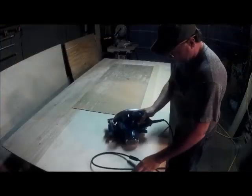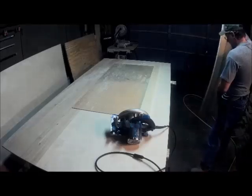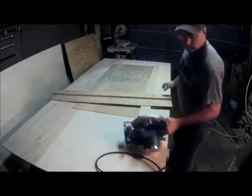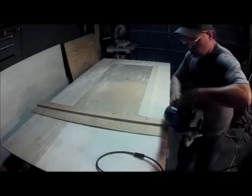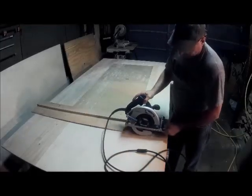That's what I'm about to do here, lay the plywood out. But I wanted to show you the sacrificial board first, so whenever I make my cuts, that's what I'm cutting into. I got a new saw probably 6-7 months ago, and I have this jig where I have a straight edge, a piece of plywood, and anywhere I cut a straight line, I can line this up exactly on that mark, and then take my saw and run it against this board, and it'll cut straight.